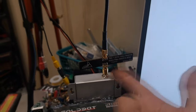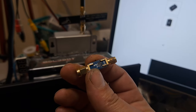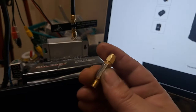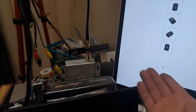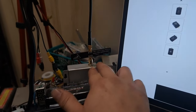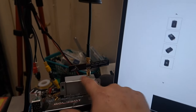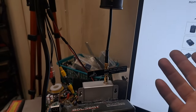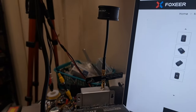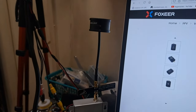The name of the game is to get the best signal with the right antennas, not blast as much power as possible — too much power can actually have adverse effects. For 1.2 GHz I've got notch filters on everything. You could try low-pass filters, but notch filters are supposed to be less lossy. Some people run splitters and do all kinds of janky stuff with different antennas — you want to match your impedance on transmitter and receiver without using a ton of different connectors, because you'll lose signal.